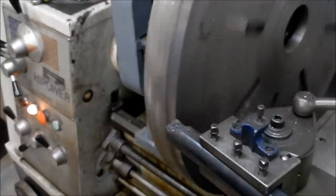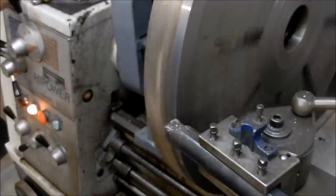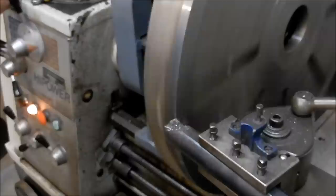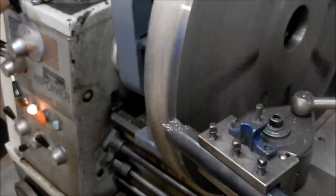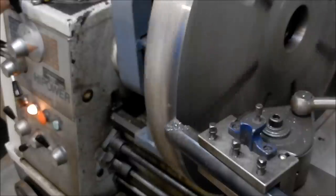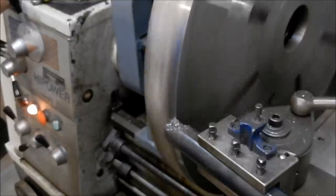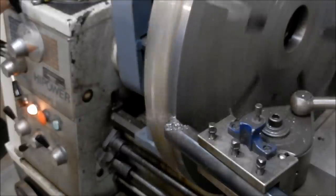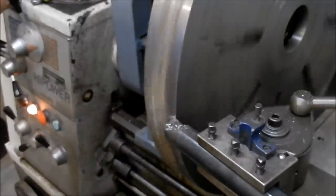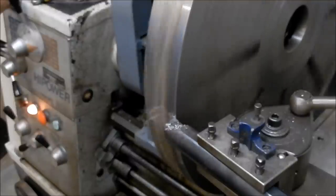Do that in one cut. I'll take off about 0.2, let's see how that feels. Just up that RPM a little bit. Getting a full diameter cut there. Let's see how it goes when we get to the end here to see if it's still cleaning up all right. But honestly, when you eyeball that, you can't tell it's out of there.